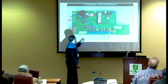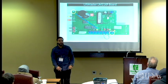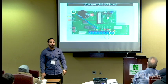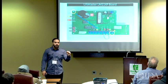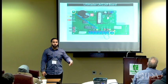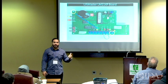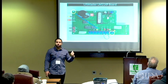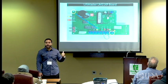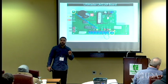And guess what's going to happen? On that other little board over there, it's going to make that piezoid go off, we talked about, and it's never going to drop out. So if you quiet the piezoid down so you can get off the job site, and then it's time for you to do your annual test, the door is not going to release because the board has inadequate power to it. It has the incorrect power supply to it, and it's going to damage the circuit if left unchecked, okay? So you want to make sure you got a true regulated source of DC power.